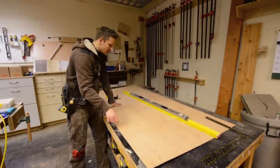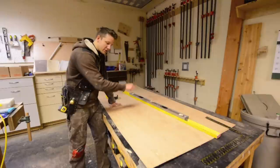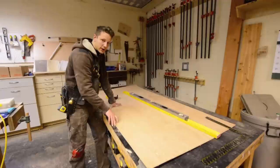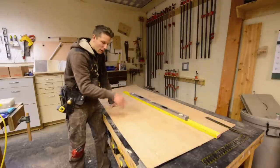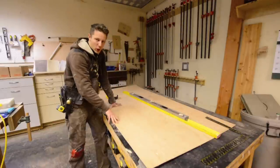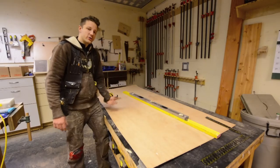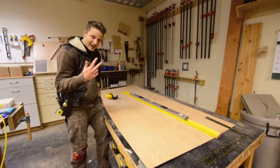Lay it all out full scale on the door skin. Use a utility knife. Cuts right through it. Make all your templates right out of the door skin. Transfer them onto the wood. Trace it out. Cut it out. Put it together. You're done. Boom. It's the only way to go. It's the way the Japanese do it. Try it out. It'll work. You'll love it. You'll never go back. All right? Let's get cutting.